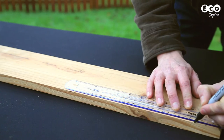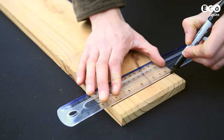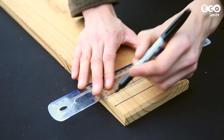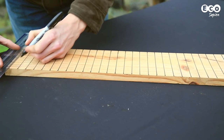To start with we'll need to give the hedgehog some extra grip to stop it sliding off the ramp. We're going to cut parallel lines along the length of the plank of wood using the saw. It can be helpful to measure out the lines using a ruler and mark them with the pen. We've drawn ours about every 2cm.